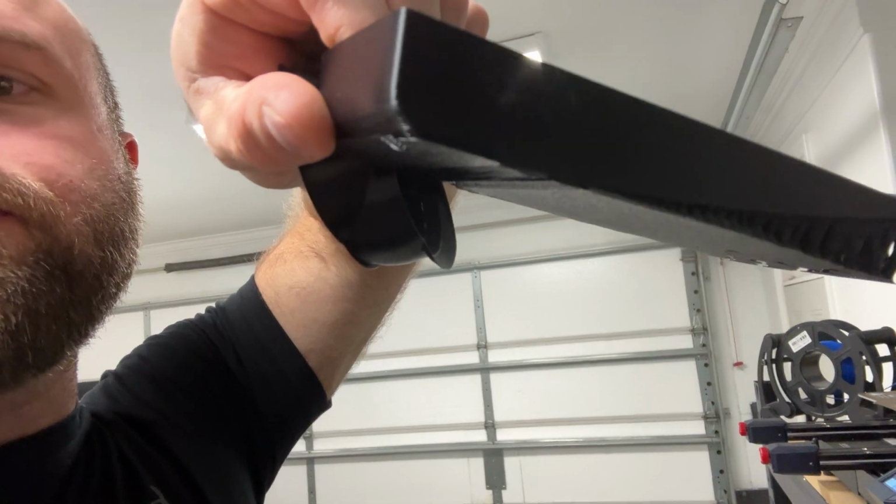and also here, it kind of pulled away from the bed a little bit, so maybe it's inconsistent heating in the nozzle as it moves along, because the footprint of this model isn't very large. Someone was saying maybe it was the lag time, the travel time between the far end of the bed and where it's coming from, like the plastic's too cool, causing it to kind of shrink, contract a little bit.